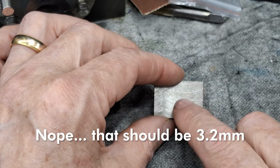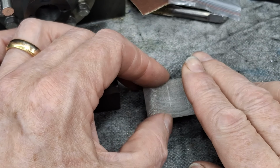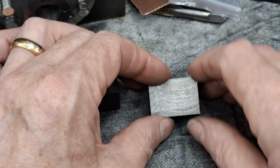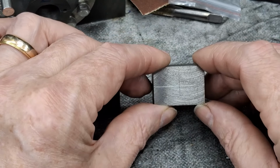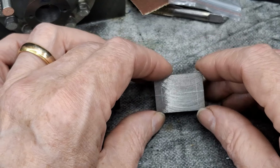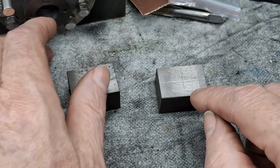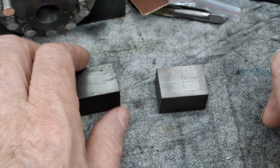We are then going to go to the lathe, and we're going to make a 10mm mandrel that will go through here with a nut and a bolt. Not a washer, sorry. So that we can hold this up against the jaws of the chuck. And then we're going to turn the 16mm boss that we need here that we'll check each one individually, so that we're making a left hand and a right hand again, of course.